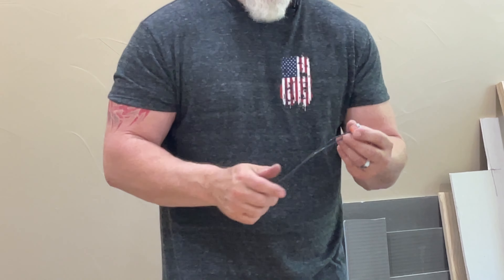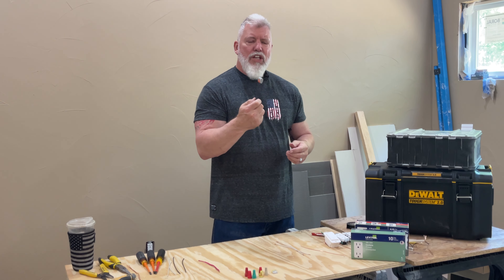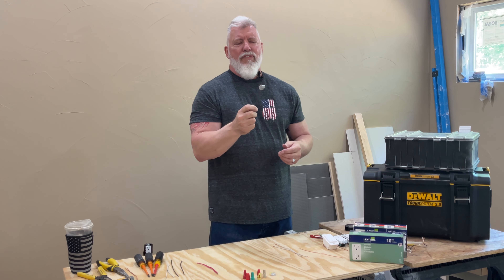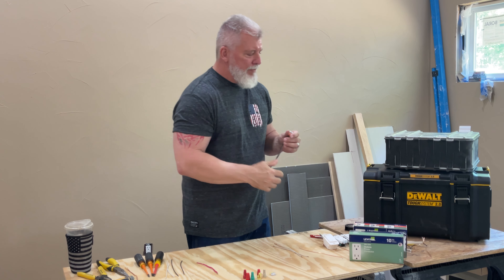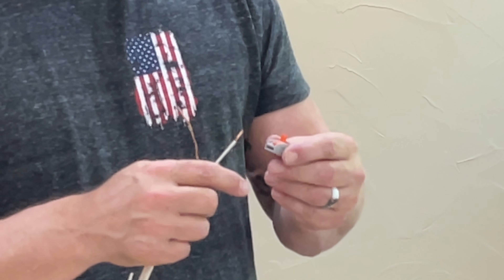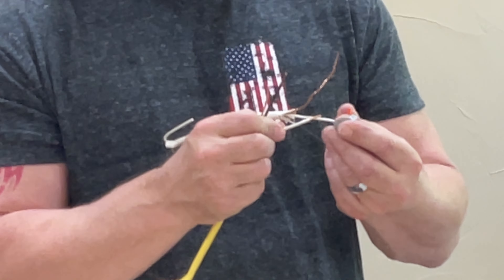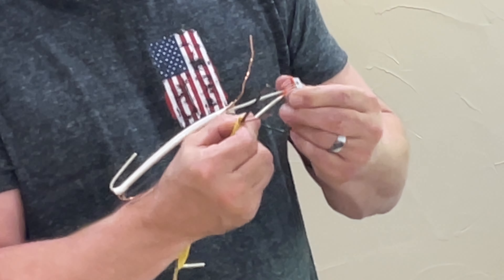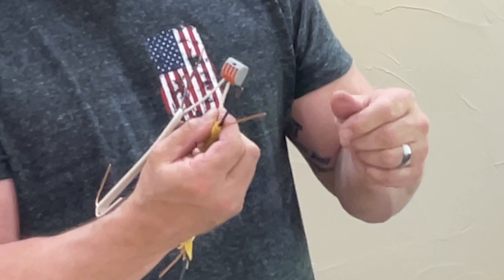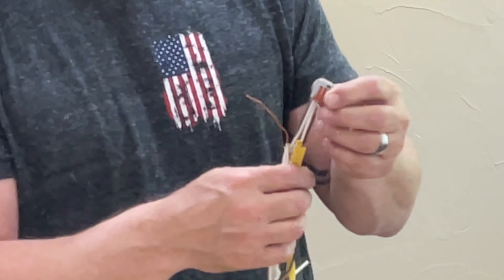One of the biggest advantages is that where you need all these different wire nuts for different size wires, the Wago will actually accept a range — I believe it's 24 gauge all the way down to 12 gauge — in the same connector. So I can take a 14 gauge wire, put it in, no problem, and then take a 12 gauge wire, which is a little bigger — funny how the numbers work opposite in electrical — and the Wago actually adjusts to the different size wire. It saves a lot of time and energy.